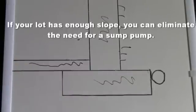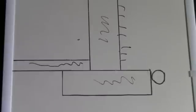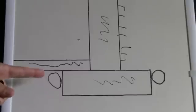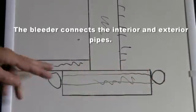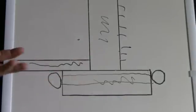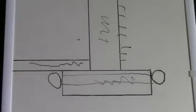This is how it's typically done with one drain tile on the outside, but a best practice is to install some redundancy in the system and actually install a second drain tile pipe on the inside of the basement. Every eight feet we install a bleeder pipe through the footer that will bypass any crushed or clogged sections of pipe along the entire perimeter of the house, so if one section gets clogged or crushed it'll bypass that section and still drain.